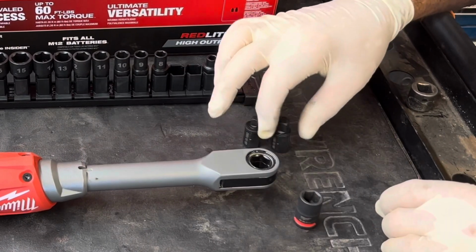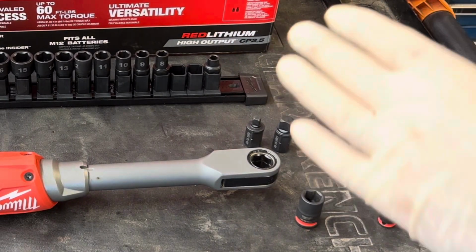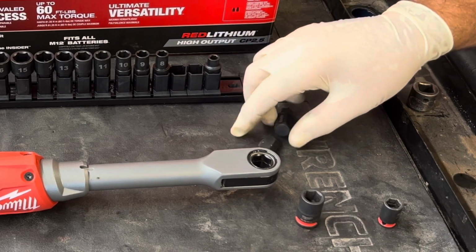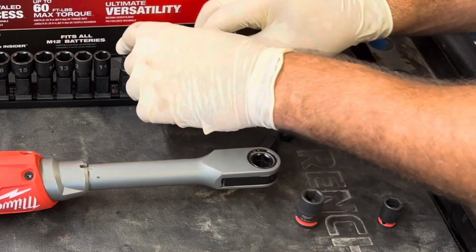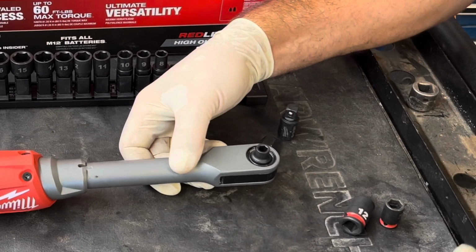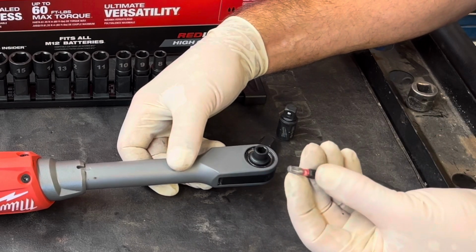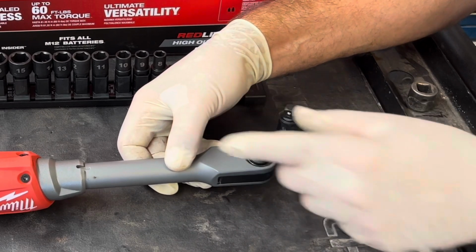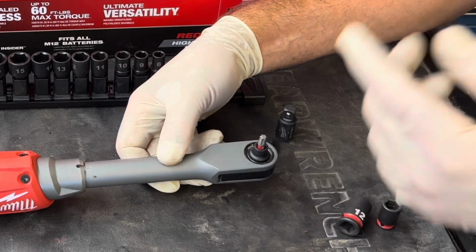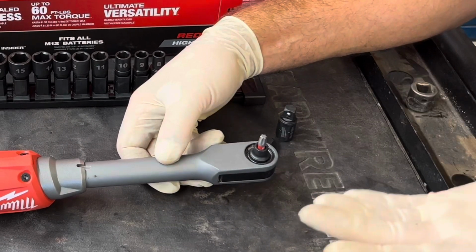These two adapters here, that is a game changer. That rules out the need for all those other ratchets, just because you have the ability to adapt it to either 1/4 inch or 3/8. And another cool feature is you can adapt it to bit drivers. So now you put the 1/4 inch bit driver socket in there. Now any bit that you want, it's magnetic. That's a Torx. I could put an Allen key or hex key, a Phillips screwdriver, flat blade, whatever I wanted to.